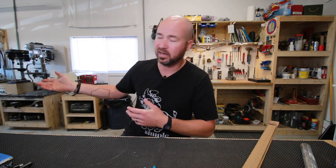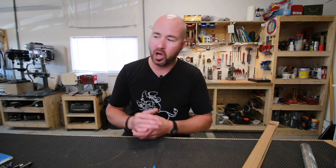Usually I like to let it sit there for at least 12 hours. So typically at the end of the day, I'll throw some knives in there, come back, take them out in the morning, and we've given it a deep cryogenic treatment. Now again, you need to be careful. These knives are super fragile, hard as can be when they're that cold, and brittle as all get out. So I'll let them warm up in the air until they're about room temperature, leave them for an hour or two to warm up nicely, and once that's done, I'll go on to my tempering processes.